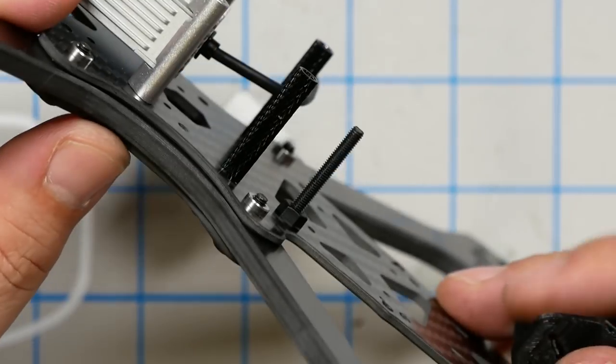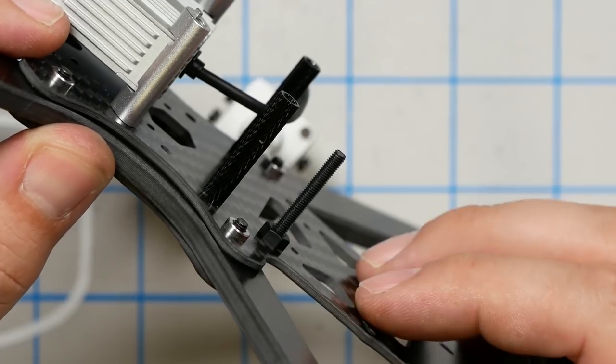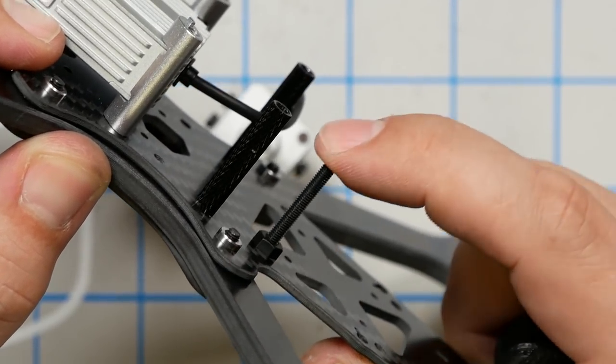There are pros and cons to each. If you go with individual standoffs, they're always going to be nylon standoffs, and they're going to be more likely to break, and you're going to end up with your flight controller kind of flapping in the wind. On the flip side, with this setup, if you do need to replace your ESC, for example, there's no way to avoid having to pull your whole flight controller off and just disassemble the whole stack. You probably were going to have to do that anyway, though. There's no question that having a single screw through the whole stack is much more durable. It also transmits more shock and vibration to the flight controller and ESC, though, than having individual nylon standoffs.